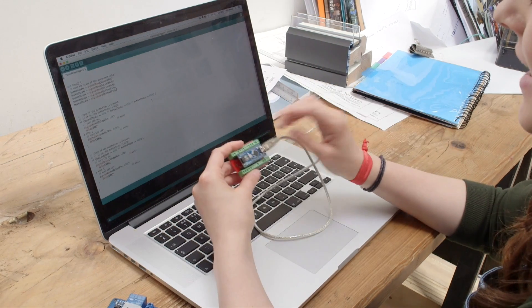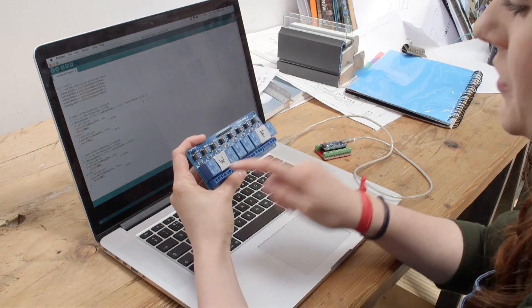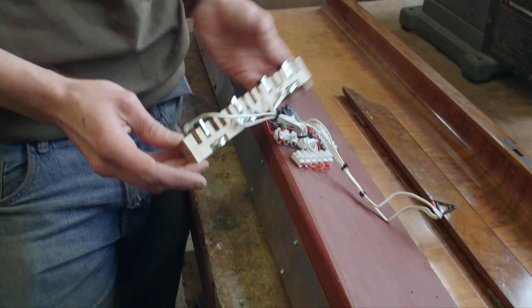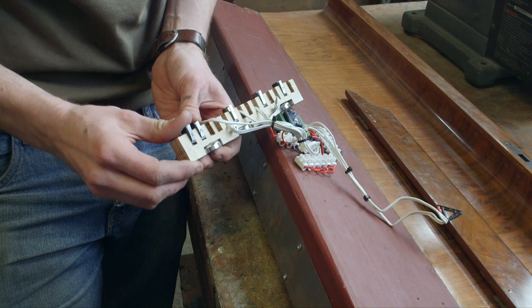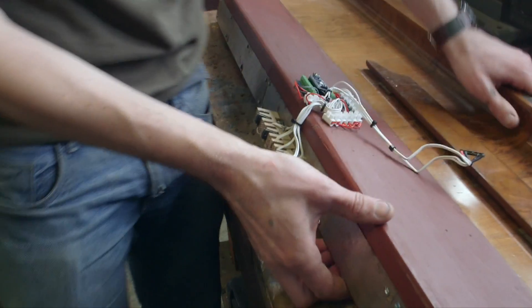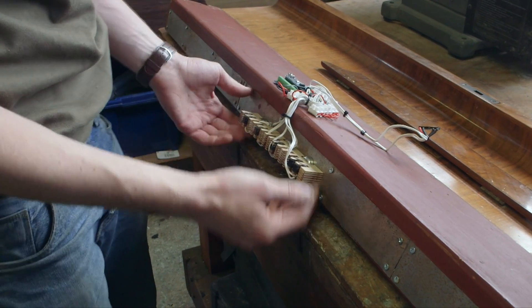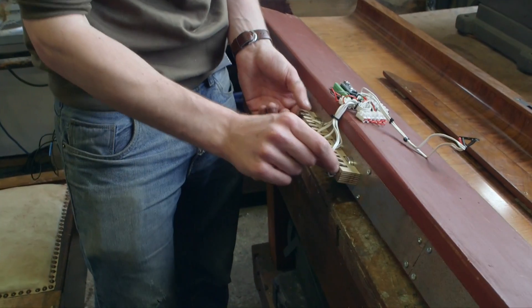So I'm just finishing up some code here for our little Arduino. What that will do is when a key is pressed on the piano, a switch will speak to our relay module, which will then activate either the pump for water or our solenoid valve for the fire. So here we've made a bit of plywood with some holes and some little slots cut in it, that we can stick our little micro switches in. We've put some magnets on the back of this bit of wood so we can mount it on the piano. This is actually the lid of the piano that you lift up to get at the keys, and we've screwed some strips of steel to it so that it's magnetic. We can stick this part on there and basically move this along to choose the keys on the piano - we can choose any keys we want and move the switches around in each of the different slots to pick any keys to set off our fire and water effects.